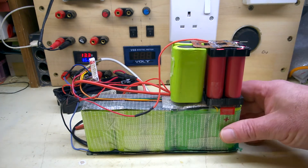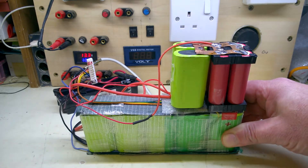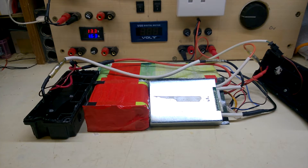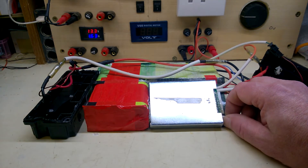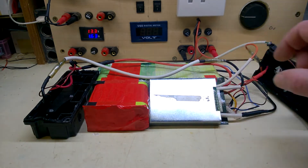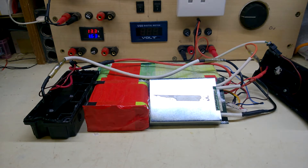Let's put some tape on this. I have to solder that back on because it's copper strip and I don't have the power available to weld it. I think that's reassembled the right way — so many wires. This BMS has to be at a jaunty angle because it won't lie flat, as per last time. I just need to connect up the balance plug to the BMS and see if it accepts the charge first.